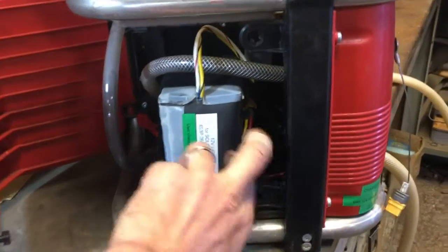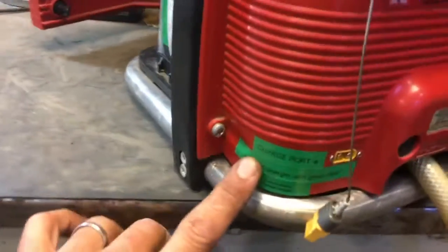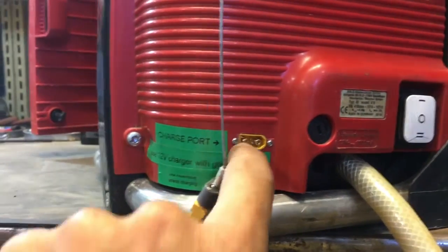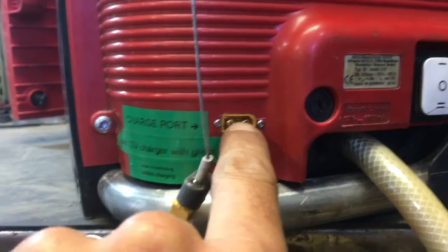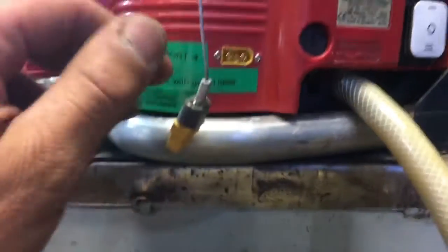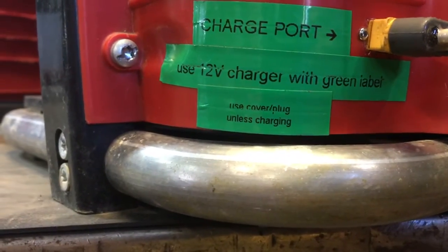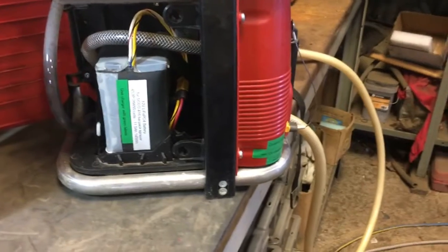This is pretty much wrapped up. The battery is installed and connected to the pigtail that also runs over to the charge port. This charge port style, being the only kind with a bulkhead panel mount I had, leaves the contacts a bit exposed — if you bridged them it would arc. The other half of an XT connector is safer. What I did was make a cover with a label saying 'use cover unless charging,' tethered to the case. I think that's safe enough.